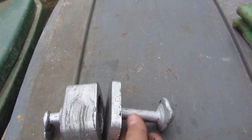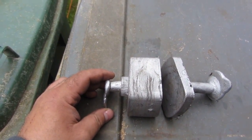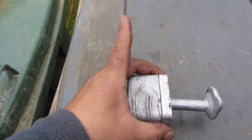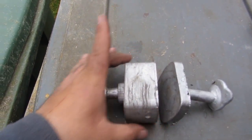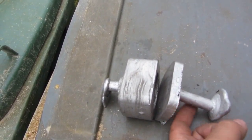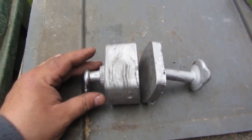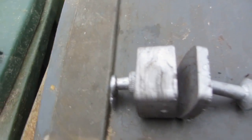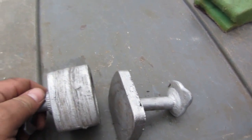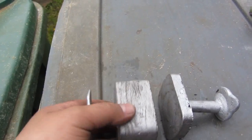What mounts onto this gearbox is a sewing machine motor. The idea of this gearbox is to reverse the direction of these sewing machine motors that spin anti-clockwise, because we need a clockwise rotation for the lathe. We also need a little bit of torque from the gears inside. We slightly lose a bit of speed but that doesn't matter, because for turning things like cast iron you don't need so much speed anyway. The motors of the Unimat SL do go a little too fast — they spin something like five or six thousand revs which is a bit too much. These imperfections here are nothing serious — they just get ground away, sanded on the belt sander or linisher, and then it'll be ready to work on from there.